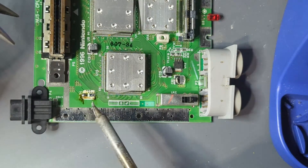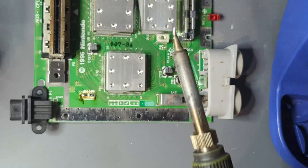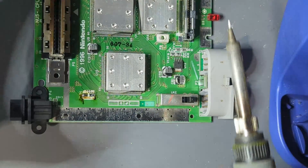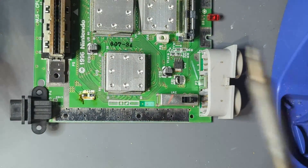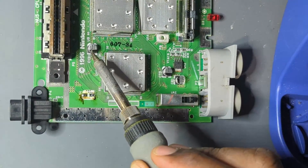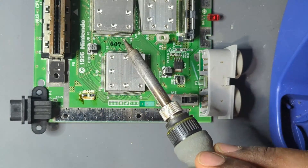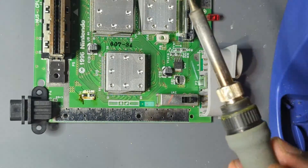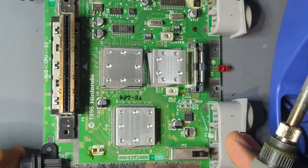When we're done we'll go through and clean up all these pads. One thing to definitely do before you take anything off — which I've already done — is take a high quality picture of your board. Make sure you can see the label on all of these, so you know where the replacements go and what orientation. You can see there's gray on one side and black on the other — that is the polarity. The black is the negative side, and that does matter. There are some capacitors where polarity doesn't matter, but in these it does.